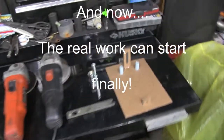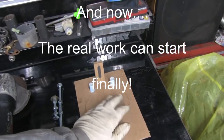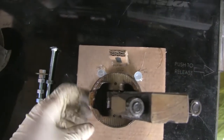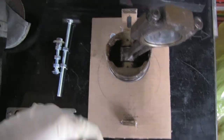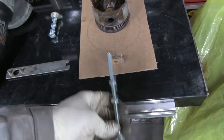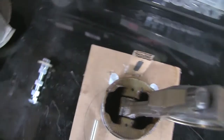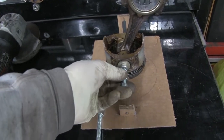So what we're doing here — this is our piston wrist pin stop. Or, well, it will be. Let me show you what we're aiming for. As I've showed in a previous video, you get it lined up back here and up here on your center line. This will be in a threaded position with a stop on it that will thread in and touch where the ring lands are to hold the piston still against those two pins, which are going to be half-inch bolts brought in from the bottom and welded. And then this hits the wrist pin perfectly.